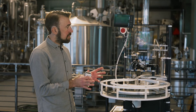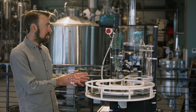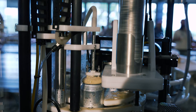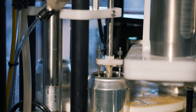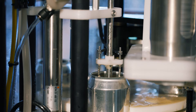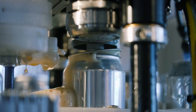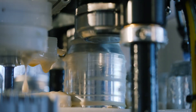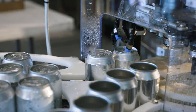We've spent a lot of effort to pare this down to just the essentials for what you need. There's nothing on this machine that you don't need — this is just the bare minimum to do an excellent job of filling carbonated beverages. One at a time, it's able to take an empty can, purge all the atmosphere out, introduce whatever beverage you're connected to, apply a lid or can end and bring that into the seamer, crimp the seam, drop it down, and rinse off any residual product on the way out of the filler.